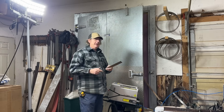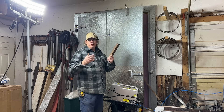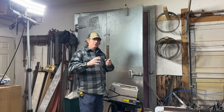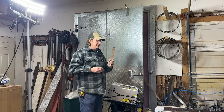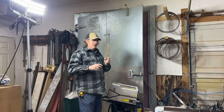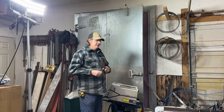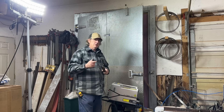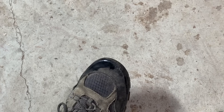To make the frame, I went out to where I have some scrap angle iron — left over from shipping implements being shipped in. I always keep that, don't want to throw it away. Using the laser cutter, I was able to cut the frame links I needed out of not only angle iron but also a piece of eighth-inch plate. I've got a layout put together that I think is going to work. And just a little side note: if you're using a laser cutter, make sure you always remember where your toes are underneath the material.